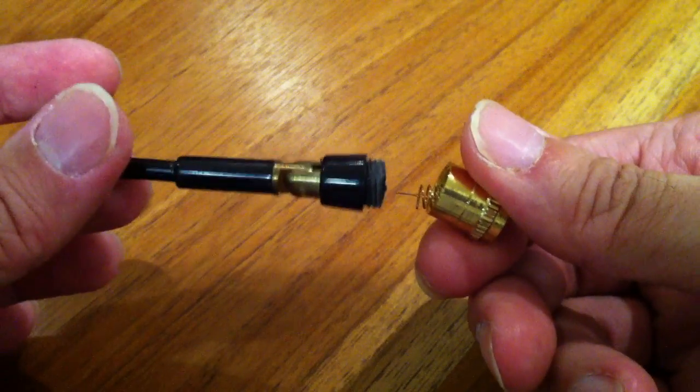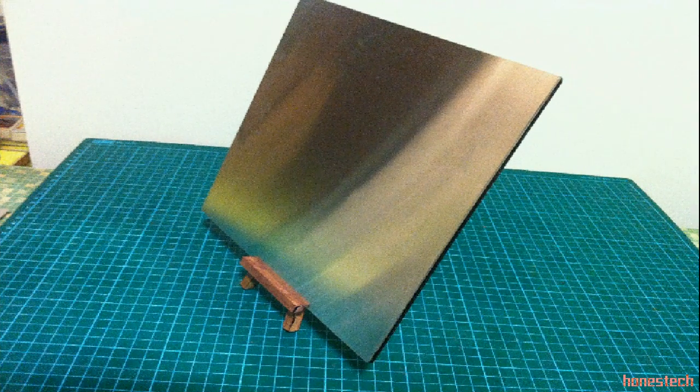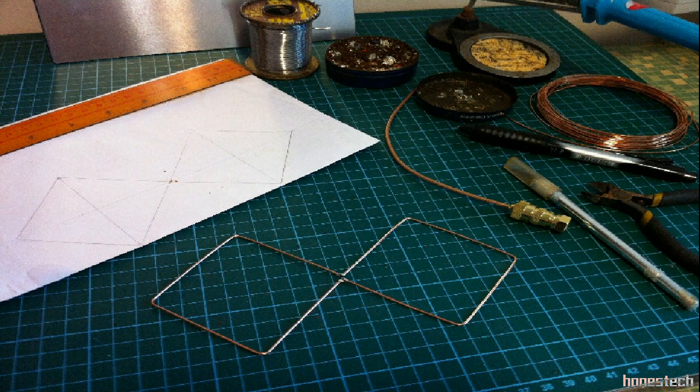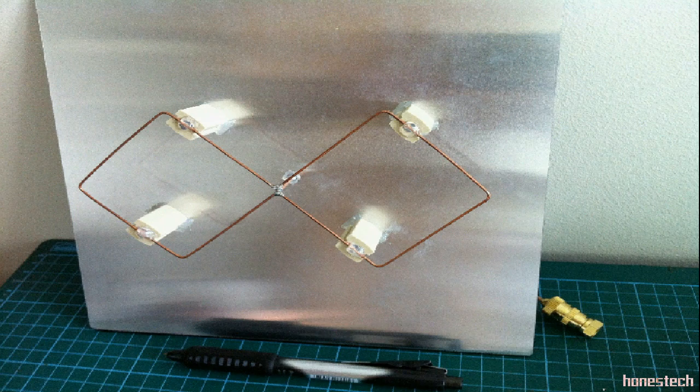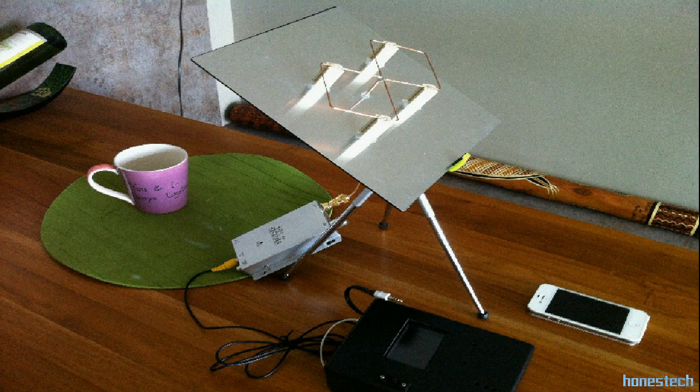So I'm going to replace this with a standard coaxial that has ground and signal, and then use a better antenna for the receiver unit. For long range reception, I opt for the biquad antenna. Basically I built the reflector using aluminum sheet and acrylic sheet. The copper elements are 22 AWG wires. These are easily put together and the completed unit could be mounted on a tripod. Let's see how well it performs.